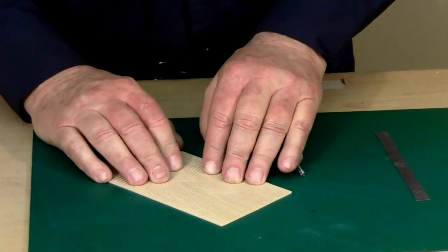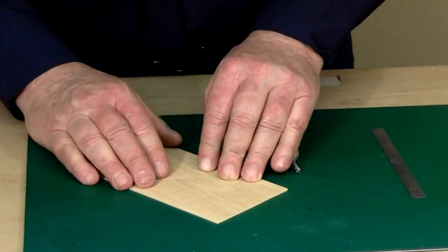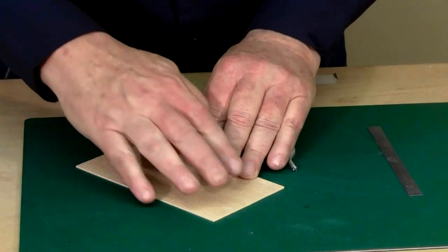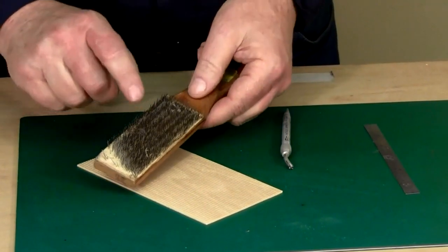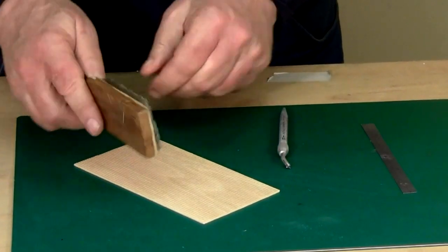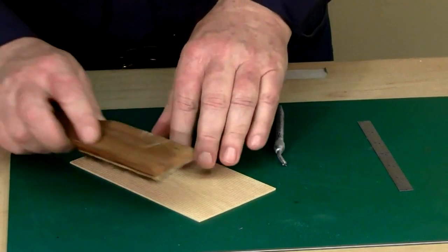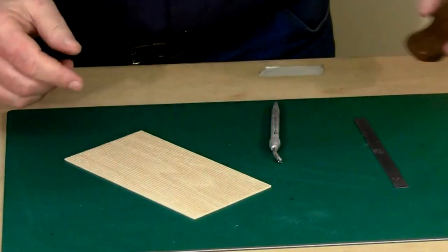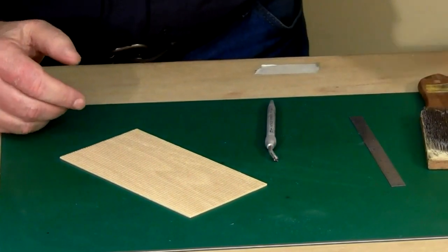What I would tend to do is prime the walls with the flat gray that we traditionally use, the Walmart brand, and after introducing the final coat of paint, I will use something similar to this. This is really a great idea though, Jack, to scrape away the final coat, revealing some of the gray beneath it. And in that way, you're introducing the same look of a distressed board because you're revealing the 2 coats of paint that are both thinned out and working with each other.